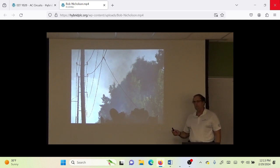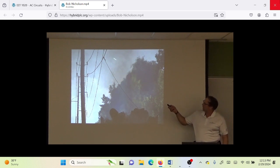Now, if you're at home, and the lights go on and off three times, you know why that is? There's probably a branch touching that. That's why they trim the trees. It's a recloser, an electronic breaker turning it back on three times. It's trying to blow the branch up.